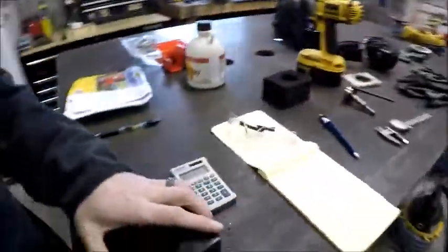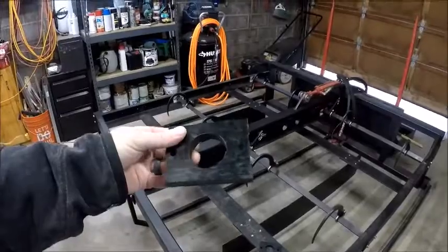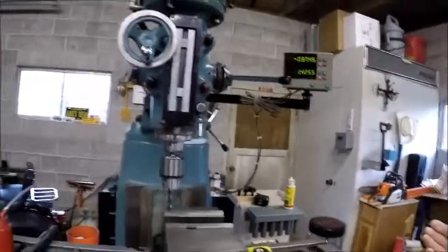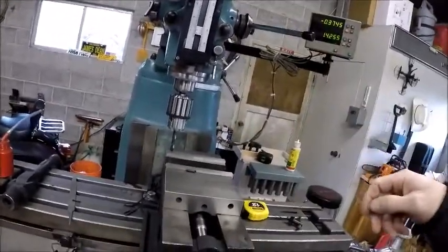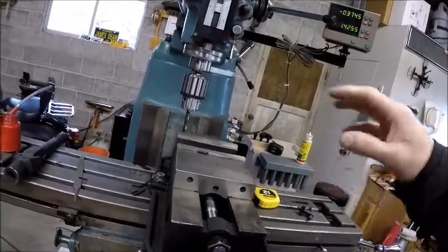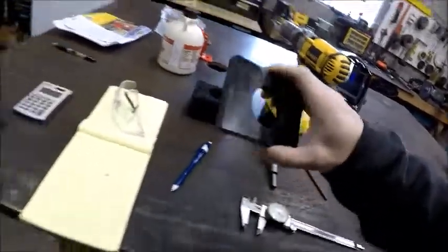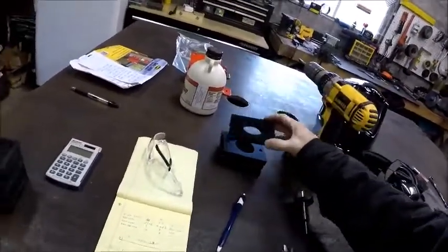On to the milling machine and machining parts. We're making new bearings for the hay grapple. This is going to be some real simple milling footage, but for those unfamiliar with it — you have your X, Y, and Z axes and your DRO. I already did the 1-and-11/16ths inch bore with a Forstner bit. What we're doing now is punching the through-holes for the 5/16-18 bolts to thread through and into the C-channel. Sit tight, we'll be right back.